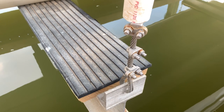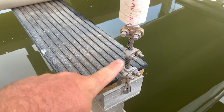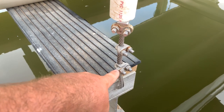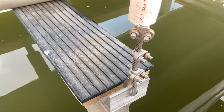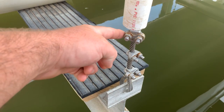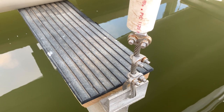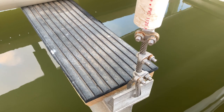When you're setting yours up, one thing to take note of is the quality of your clamps. Here we've got one that is obviously smaller than this one. I recommend getting the bigger ones — they're meatier, heavier duty, and have less of a tendency to cross thread, especially if you need to loosen them and readjust them. Be aware that not all of this hardware is created the same. You can see already some rust staining on it. It's 304 stainless, not 316. 304 is the stronger; 316 is more corrosion resistant, so rinsing this stuff off and oiling it from time to time is very critical.